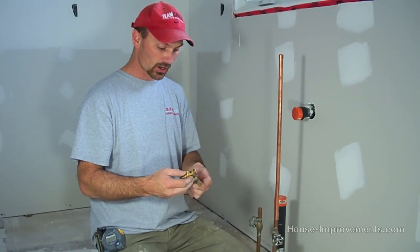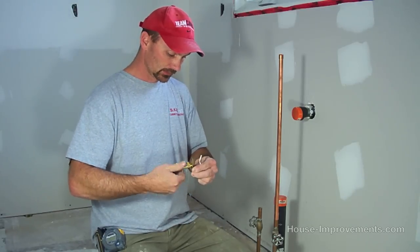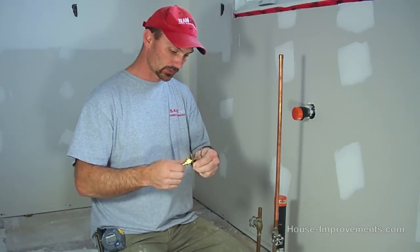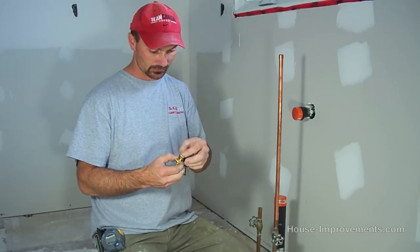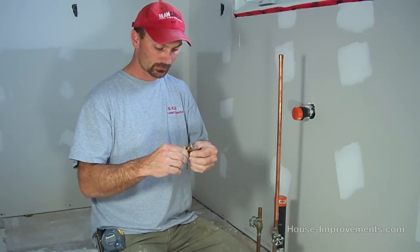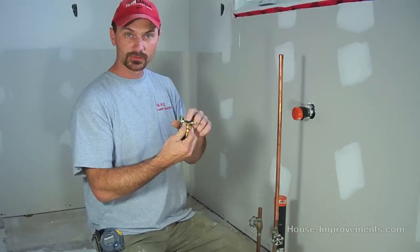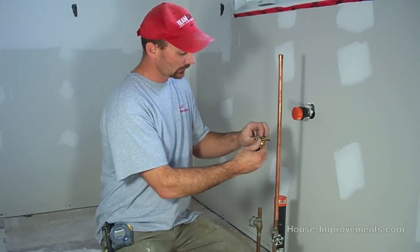So I've turned the water off, setting up my valve here. First of all, you just screw that point all the way in so it's not actually protruding. There's a little rubber gasket that then fits inside of there. And again, this all comes in this kit. There's nothing else to buy. Okay, so I've seated it right on there. I've started one bolt here just to make things a little simpler.